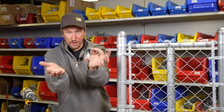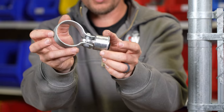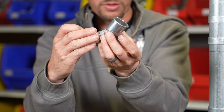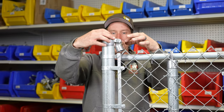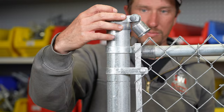You also need a nut and bolt to go through all that. When it's all said and done, you have a 2 and 3/8 brace band with a 5/16 by 1 and 1/4 inch nut and bolt going into and through an inch and 3/8 aluminum rail end. This sits on top of the post just like that and terminates — that's how the top rail terminates into the terminal post.